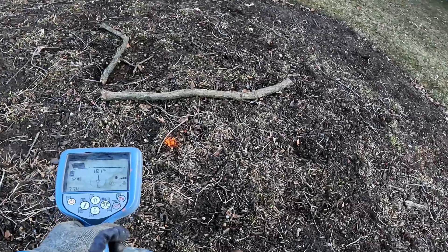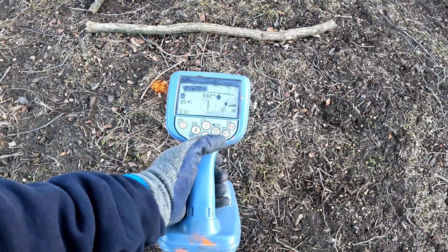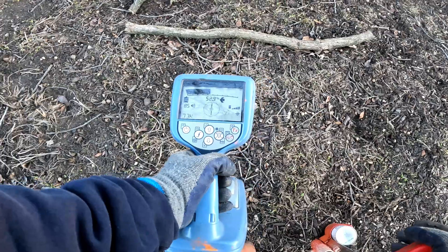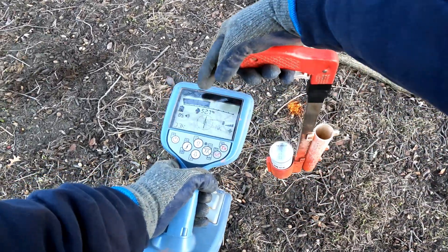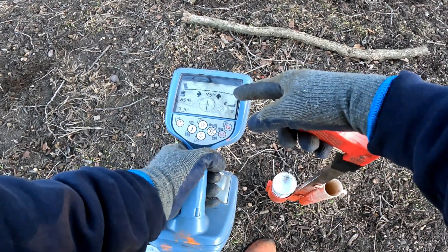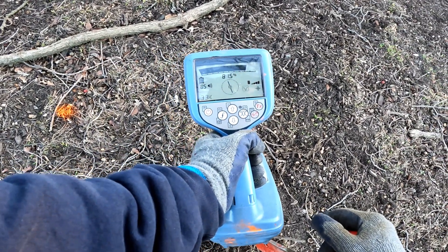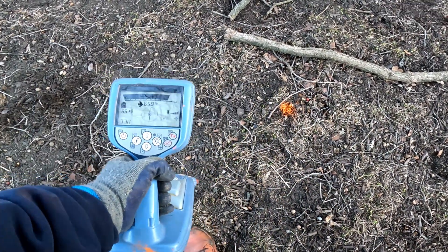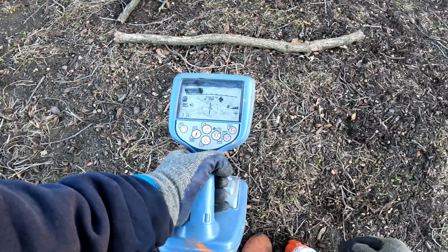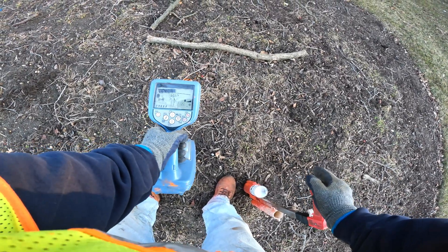I was high on my transmitter, so I'm going to null it and see if my null lines up. See how the peak ramp shot up — the null lines up with my peak. The peak ramp is right on top, and you can see how high it gets when I'm far from the cable, and how low it gets when I'm over the top. The arrows indicate you're directly on top of the cable. When you're nulling out you want a perfect null like this — dead nuts on your cable. Yes, it's a foot deep — it is what it is.